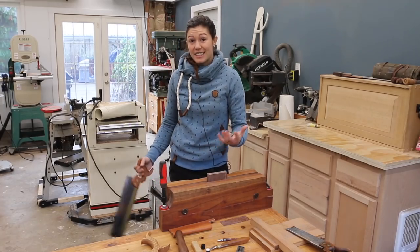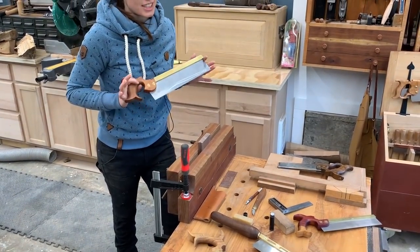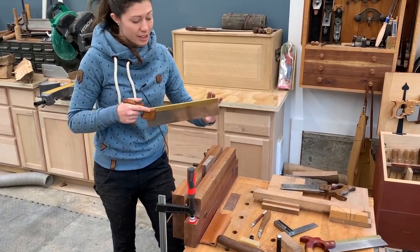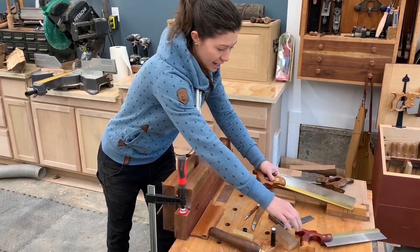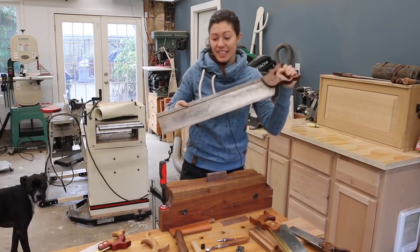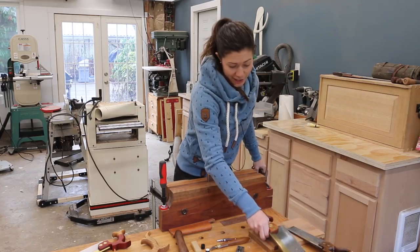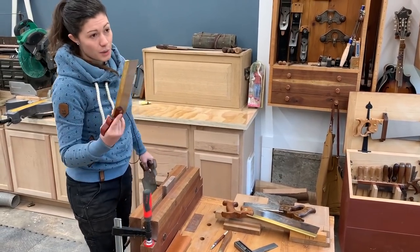When I'm considering my woodworking budget I like to have as few tools as possible to do the jobs I want to do well. This is one of my favorite saws because it's a great all-around size — I can do 99.99% of the woodworking I do with this saw, as you'll be able to cut as deep tenons as I generally use. It's still small enough and wieldy enough that you can use it to cut dovetails if you need to. That said, if I am cutting dovetails it is a tad unwieldy and I really do prefer a much smaller saw. I also have monsters like this which, as you can see by all the dust, don't get used very often, but if you're feeling luxurious you can restore an old dovetail saw or invest in a quality dovetail saw as well.